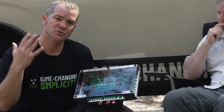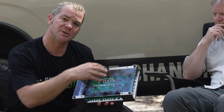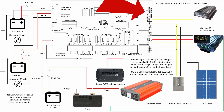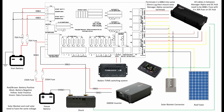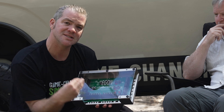For example, if you've got a boat with two motors and two alternators, you can feed the DC Hub Dual individually from two start batteries, because this unit is capable of having two DC-DC chargers connected to it. On this side you now have space for DC-DC charger one and DC-DC charger two, with their own dedicated solar inputs as well. You can use a Renogy Alpha 100 which can put 100 amps of charge into this unit, splitting the outputs over two DC-DC chargers. Or use two DC-DC chargers — it's compatible with Redarc, Enerdrive, Projecta, Victron, and whatever else you find.